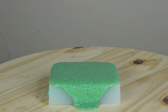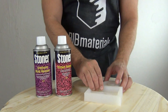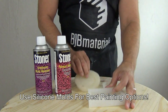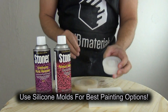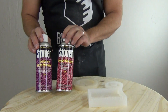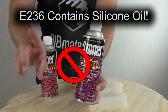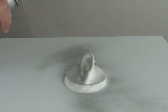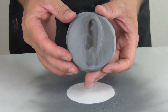Number five: wrong release agent. This is a big one that can sneak up on you. If you will be painting your finished cast parts, make sure to use a mold release that is paintable. Do not use any mold release that contains silicone oil. Remember that some paintable mold releases will need to be washed off the cast part. If you know you are going to be painting the finished part, you should also avoid casting into polyurethane molds as they require a much more potent release. Here I am avoiding E236 and using E302 as it is a paintable release formula. E236 has its place, but not for resin parts that require painting.